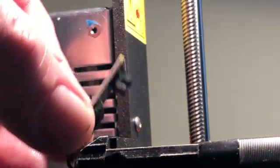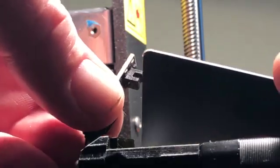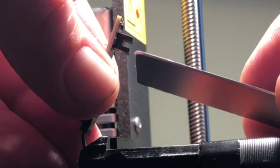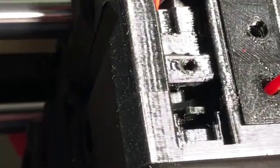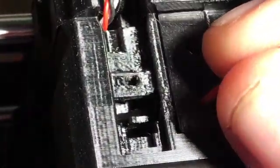I'm trying to do some diagnostics on the sensor — it's not detecting a load. I put something in the way of the sensors — a hotel card key — and there's no change in the support menu, so it's not detecting anything going in the way. I'm pretty sure the sensor isn't working. Another part of the troubleshooting is the mechanical end: looking at the top of the extruder, when I pull this out a little bit moves out of the way, so my mechanical part is working just fine. It's just the sensor that can't detect it.